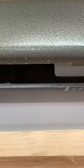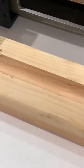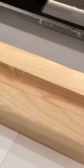How often should I oil my machine? Well, we like to oil our machine every 8 to 12 hours of stitching. That's 8 to 12 hours of continuous stitching of work, and then follow the oil procedure, depending on your region. If you're in a very dry house or a very arid region, you might want to oil it a little bit more. I like to see a drop or two of oil on the bed of the machine in the morning when I go to work, and then I know that that oil is indeed migrating all the way through my machine and it's getting enough oil.